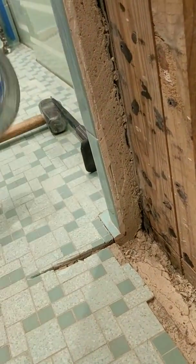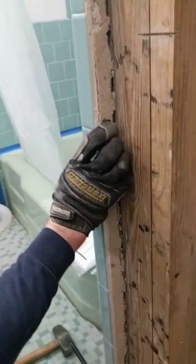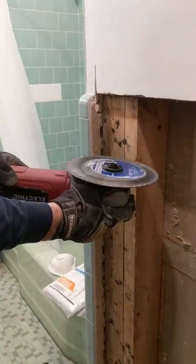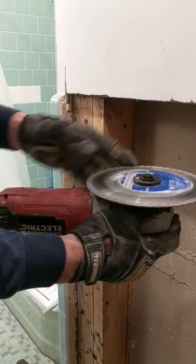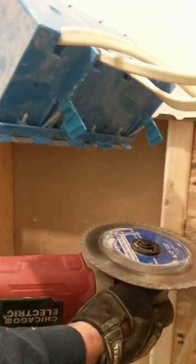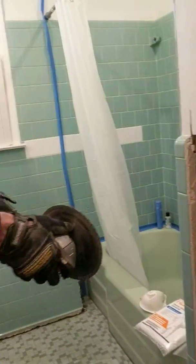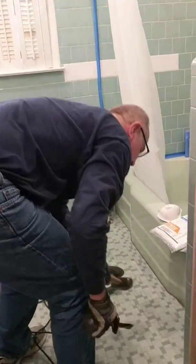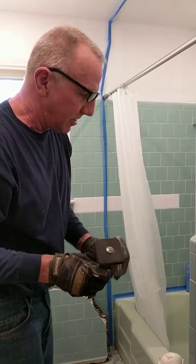to the bottom. The third cut you want to make is come horizontal about 5 inches or so below your top cut here, just all the way across. And then you're done with your Dremel saw cuts. When you get that done, now it's time to start removing tile.